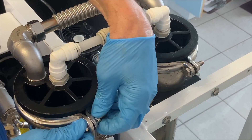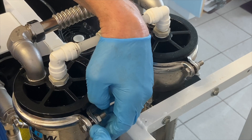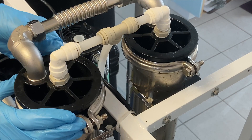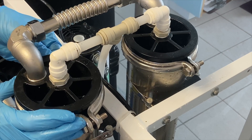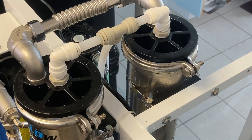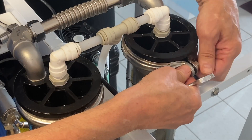When you tighten up these clamps you need to be careful that the gap is the same on both sides to make sure you've got equal pressure. At this point we can lose the gloves because they just make things more clumsy. Go back and forth tightening — righty tighty, lefty loosey — adjusting until the gap is the same on both sides.